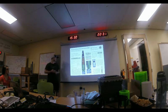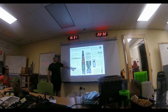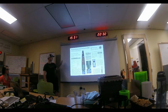We were asked for a 99.8% successful deployment rate. We haven't done enough testing to verify that yet, but once we had the final system in its final configuration, we haven't had any problems getting it to release, so we're on track. Our most desired failure mode is drogue deployment at any stage — as long as the nose cone gets released, that should happen. We also wanted actuation within one to three seconds; our recorded times average 1.15 seconds, which is pretty fast.